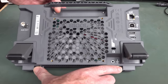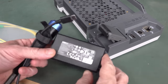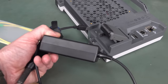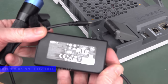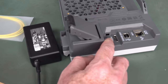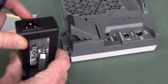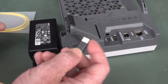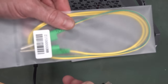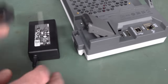It looks like we've got four screws here, two up there, and the back should just lift off. Now, because this is USB-C powered, it does come with a fully certified power brick. I'm not going to take that apart because it looks like it's ultrasonically welded. But it's got full certifications. And because it's USB-C powered, it is technically isolated. I measured one meg from the earth to the shield, so it's not directly connected — it's got a bleeder in there. That's why they provide a handy little low-impedance earth lead which goes onto the chassis.